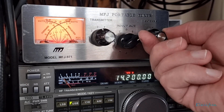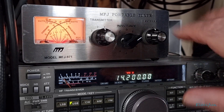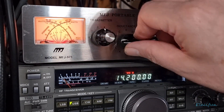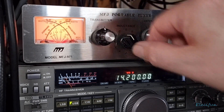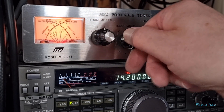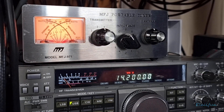We're going to turn these to the 12 o'clock positions and what we're going to listen for is the noise. So that's going quieter... quieter even still... there it seems to be very loud. And as we change on the inductor - quieter, quieter, to almost nothing, to a lot - so we're going to say there.